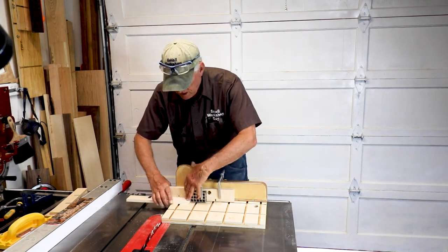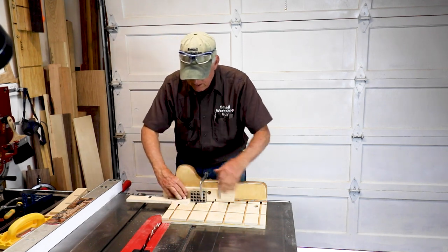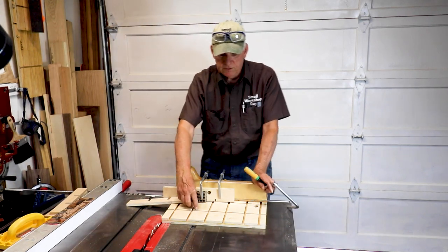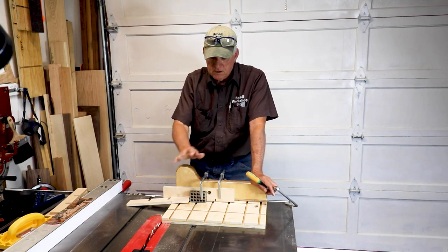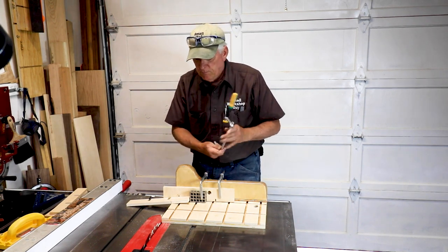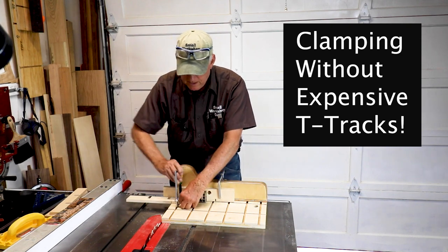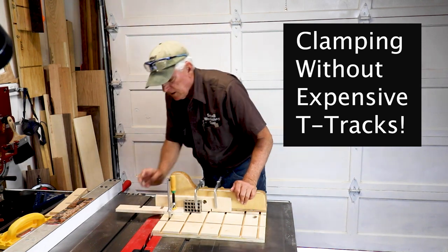I'm a little nervous about my hand being down here and I can't really put a clamp over the workpiece. That is pretty much the entire reason for doing a match fit cross-cut sled. I just slide a match fit clamp in here and hold it down, and my fingers are going to be nowhere near that blade — so I can do repetitive cuts time after time safely.